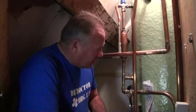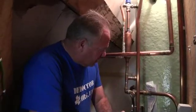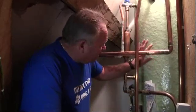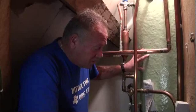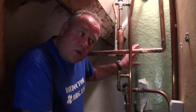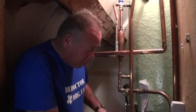There are pressure release valves which you can see at the top. If the pressure gets too great, the pressure is released. One of the main features about this is that this particular tank has a couple of outlets which allow you to fit solar power to it as well, so you could receive solar energy from the roof that will also heat the water in here. The thing we're going to be talking about primarily today is the fitting of a wood burning stove with a back boiler to this system.